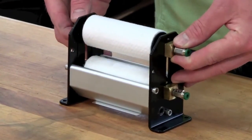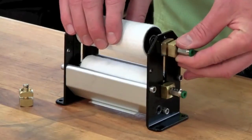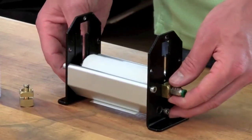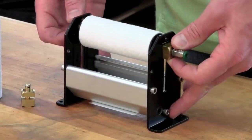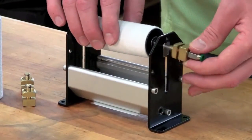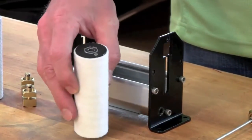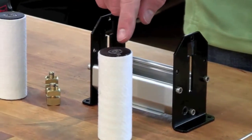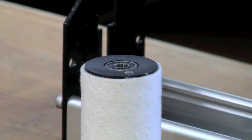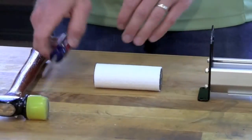To remove the old roller assemblies, grab the upper roller stub shaft and dispenser tube and slide them up the end plate slots until you can pull the stub shaft and dispenser tube out of the square hole at the top of each slot. Next, grab the lower roller stub shaft and dispenser tube and remove them in the same manner. There is a coil spring on the stub shaft and dispenser tube — be sure that these don't fall off while removing these items. Note that the end cap on the lower roller assembly has a magnet installed on one end of the roller. This magnet is used with the roller rotation sensor to send input signals as the roller rotates.